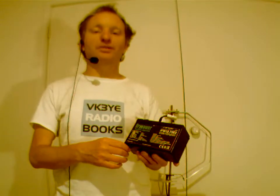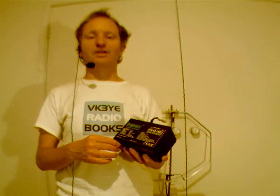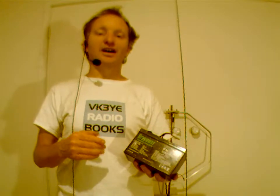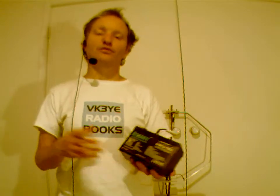Most of the time with QRP, you're spending on receive, maybe 80% of the time tuning around, listening, monitoring. So receive current consumption is really important. And that's where a specialized QRP rig can help, because something like the FT817, 818 is okay at 300 or 400 milliamps on receive. The Elecraft's draw, I think, about 150 milliamps.